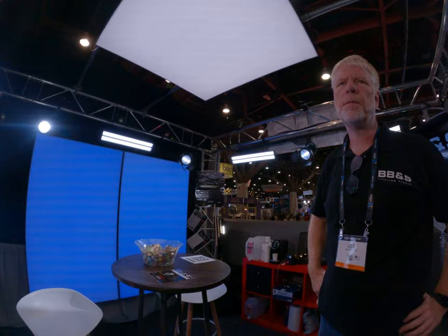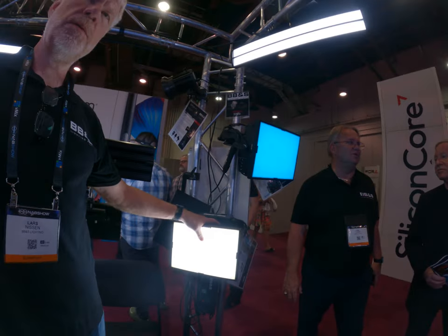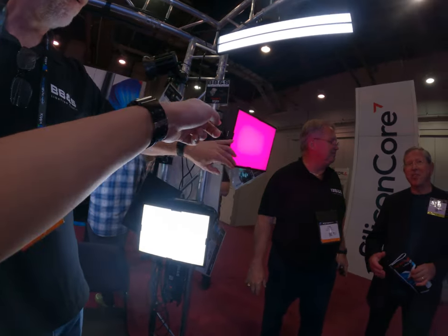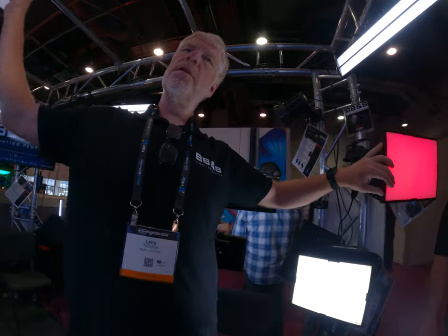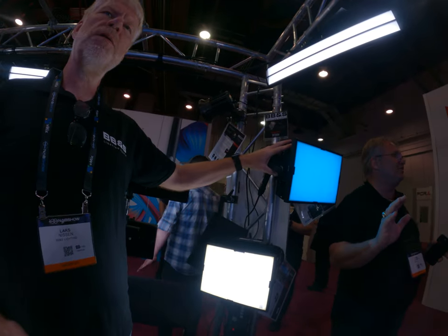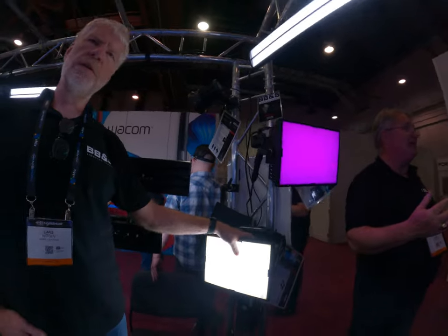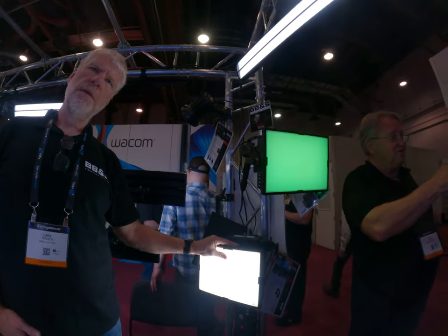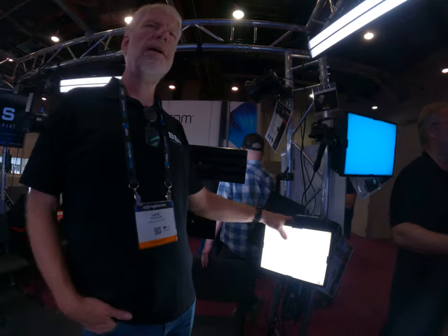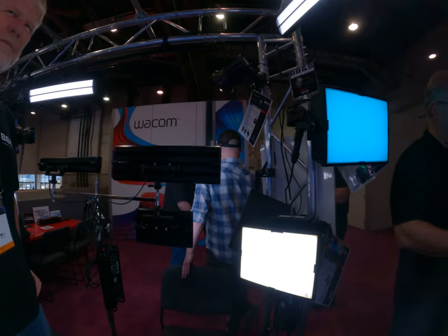And how about these RGB panels? There's a fixed color, which also has the phosphor technology in front, so you have the phosphor plate with a fixed color. Or we have the color version, which has the same diodes as the light boxes, so they're mixing together. That's RGB, and you can put it in CCT mode, so you can work with the colors. We go from 6,000 to 2,700, and on this one you go from 10,000 to 2,000. Okay, wider range. Especially because of the film industry, we need more range. It all depends on how you play those numbers you need.